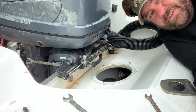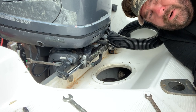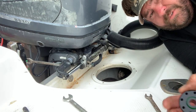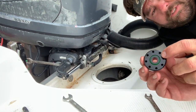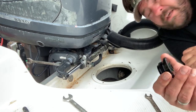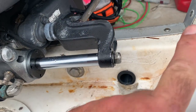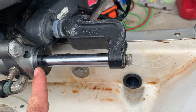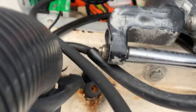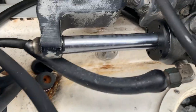We got a new seal, new end cap right here — it comes as a complete set. I usually get OEM on this but I found some aftermarket, gonna give it a shot. There is a specialty tool that goes in these holes to loosen it — threads up. We're gonna have to detach this ram to get it to slide off. There's a 5/8" bolt that's got to come off, there's a washer — don't lose it — and a cap on both sides with the seals inside.